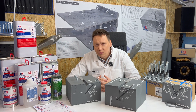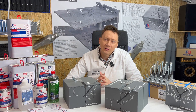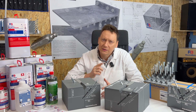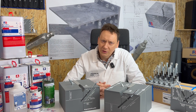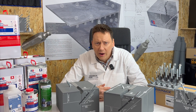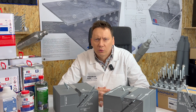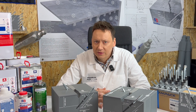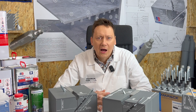Packer removal. Best to remove the packer the next day to allow the resin to harden — wait at least 24 hours, but not before 6 hours post-injection. For garage floors, a protruding packer can be a tire hazard. Opt for a one-day packer for immediate removal after injection. To remove, use a screwdriver and turn gently. Wait 2 to 3 hours, then attempt to take out the packer.